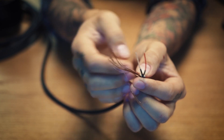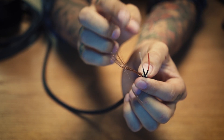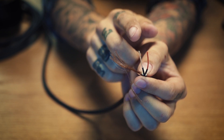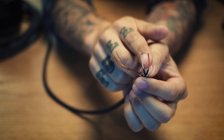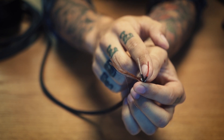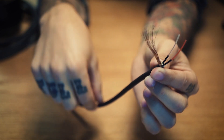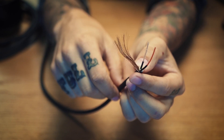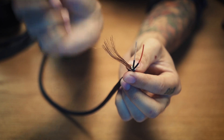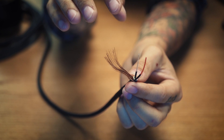How this balanced cable works: from the signal source — microphone, balanced line out, or whatever — you send a signal through those two signal cables out of phase with each other. Which means if you were to get that back still out of phase with each other, you'd have no sound. So we send the signal out of phase through both cables, and when it arrives at the other end it's flipped back, which obviously gives more amplitude compared to an unbalanced cable, since we have the signal times two.